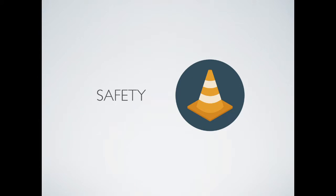Before we get into installing Trolley Stopper, first a word on safety. Car parks can be dangerous places, especially with traffic moving around them. We recommend that you install Trolley Stopper at night or at the very least when the shopping centre is closed. We also recommend that you use safety cones to close off the area you are working. Always wear safety gloves and safety glasses as the epoxy resin can be extremely irritating to your skin and very damaging to your eyes. We also recommend that you read the epoxy material safety data sheet attached to this webpage, as epoxy can be quite harmful and you should be aware of the risks before using it.